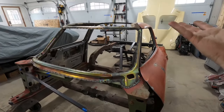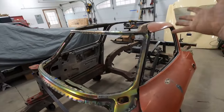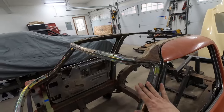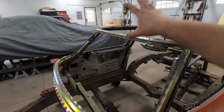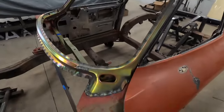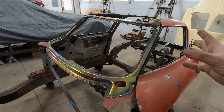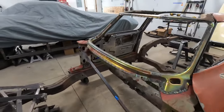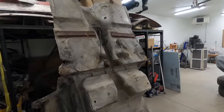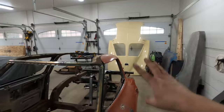In the next video we'll pull it off this frame, weld those couple spots, and I may even tip the birdcage up on its back just to make it easier to weld in the gutters. We'll mock up the new gutters, get all this rust treated, clean the whole thing, and paint it with this kind of green paint to make it look like the original. Hopefully in the next video we'll get all the gutters and bonding strips on and maybe even get the firewall installed. Then we can start working on the floor and the door jams. I'm just really excited to glue that thing onto this car.